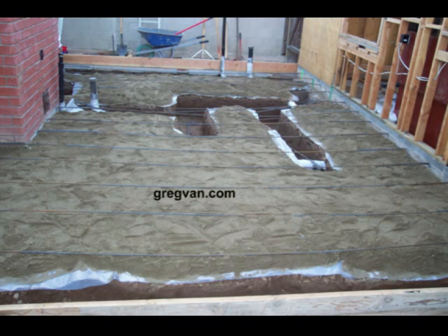For those of you who do not know what expansive soil is, this is a clay type of soil that when it is wet, it will expand and actually put pressure on the foundation. Then when it dries out, it will shrink. You can actually see gaps between the foundation and the dirt right next to your house. If there's a gap there, you've got expansive soil. If you don't, you're lucky or you're maintaining the property.